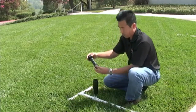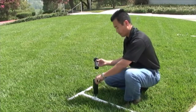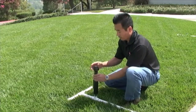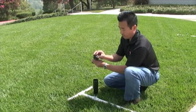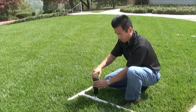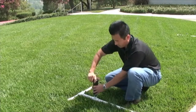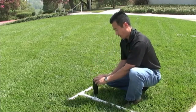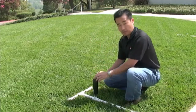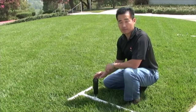and you can lift the entire internals out, and then have locating grooves here which align with the internal ribs on the body, where you can make sure that the riser and the left stop point in the right direction, and screw it down. Now I can see that the left stop is in the correct direction, and the right stop is the adjustable stop, and I will cover the adjustment of the T5 in the next segment.